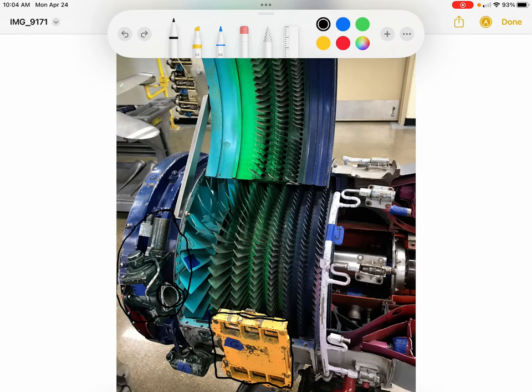And so this is controlled by the bleed valve actuator down here labeled E. So there are two bleed systems on this engine, but none of them actually attach to what's called airframe bleed. Now, a lot of students get confused. This is the cold section, but just understand when air is compressed, as the pressure is increased, the temperature goes up as well. And so by the time the air reaches the back of the compressor back here, it's typically somewhere between 400 and 500 degrees. And so that's plenty hot for producing heat for the airframe.